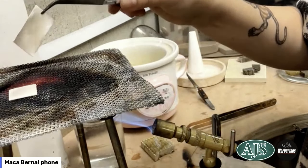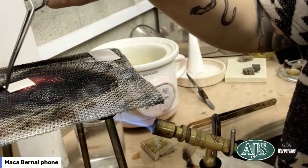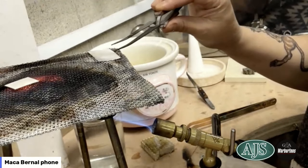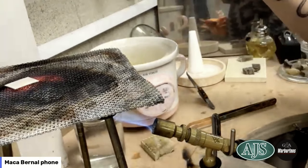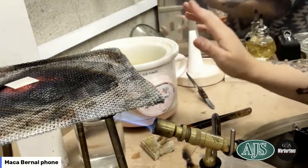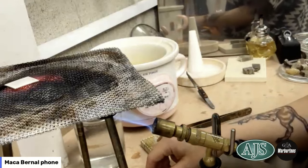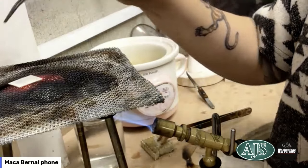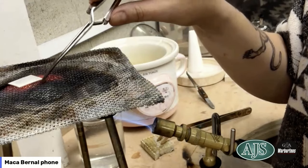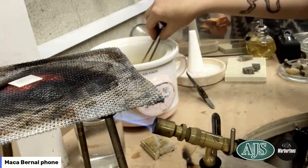This little piece that's been on the heat for a while — let it cool down. It's important that you don't quench your pieces while they're too hot. Let it rest until it loses its redness, then throw it directly into the pickle bath. Don't quench in water first — we're trying to achieve a specific effect here, not just anneal normally.